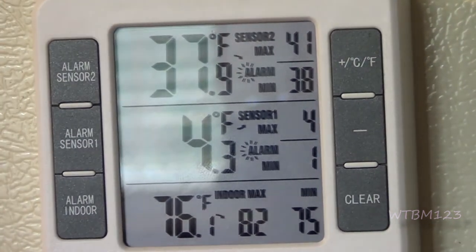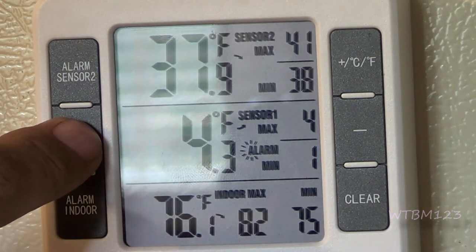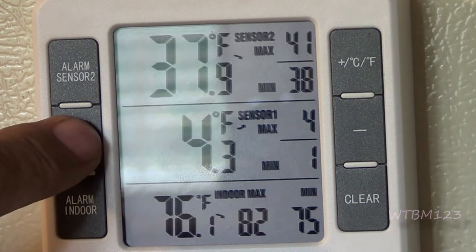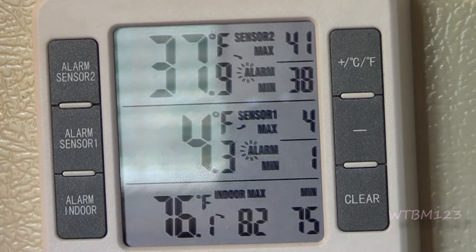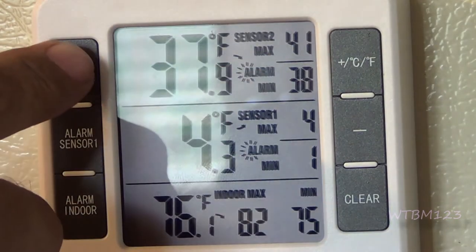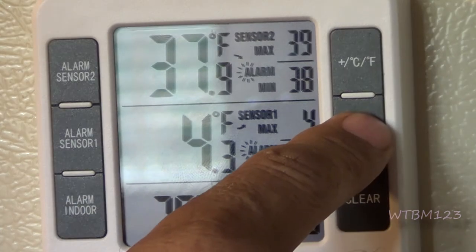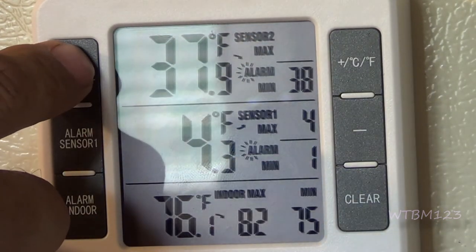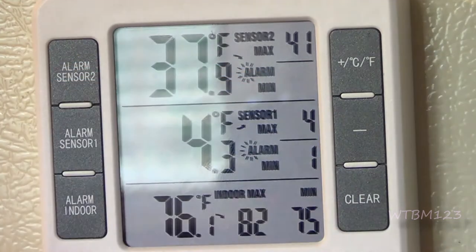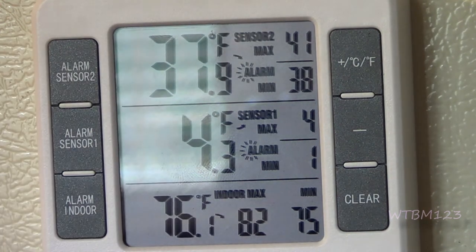Now on this alarm — if I want to deactivate it, one short press. Same as the other sensor, one short press — see, it deactivated the alarm. A short press will make the alarm come back. When it says 'alarm,' that means it's armed. Now if I want to change the upper or the lower limit, you hold this button in for two or three seconds and you'll hear it beep. See, now it's flashing 40. I can go down in temperature all the way down to 33, or I can go up. When I get to where I want — say I want 40 — I hit this button in for a short time again, and that'll make the other one flash. That's your low. This middle button will take the temperature down and this will take it up. When you get it where you want, another short press, and now the alarm's activated.